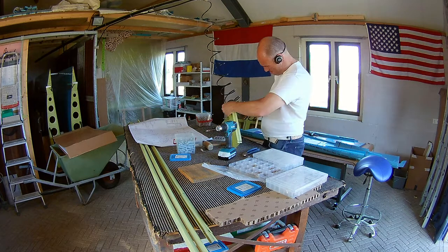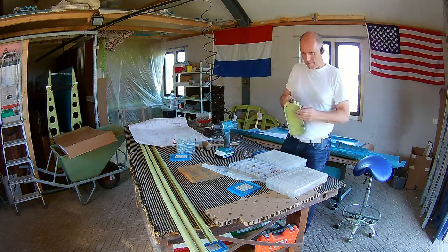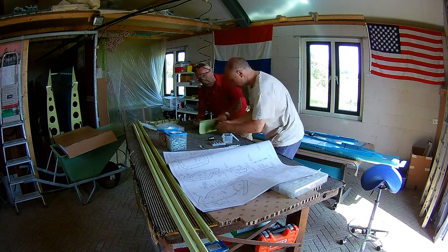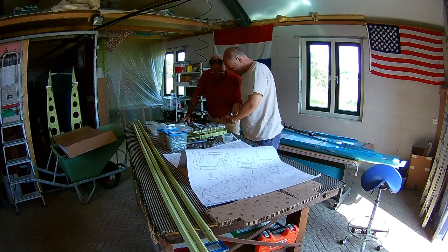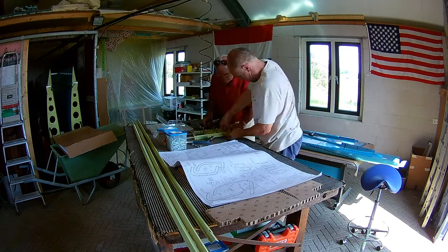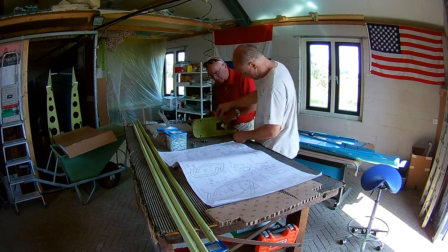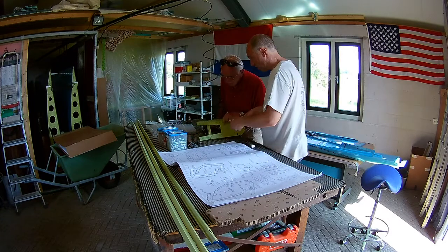And this is actually 712 I'm working on right now, so that's the last one. Not that simple — I think only 10 rivets. So that was the second day. Then we start actually assembling it. This is the 712 and the 711, the most rear two bulkheads, and we are trying to attach them to the skin. It was really hard because it didn't fit that well, and then you also have to trim stuff and get the tail wheel in there. It was a little cramped and hard, but in the end we just took our time and made it work.